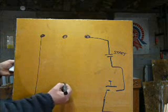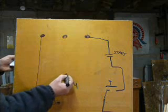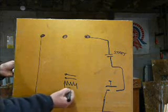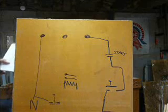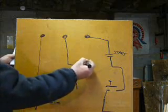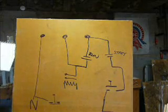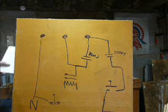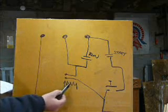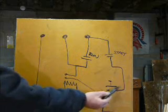Right in the middle we have the relay — that's the relay coil — and we have two contacts. This is a normally open contact, so until the relay is energized there is no connection. The far side of that goes to the motor, and also goes through the run capacitor to another motor connection. Until that relay is energized, there's no power going through any of those paths.